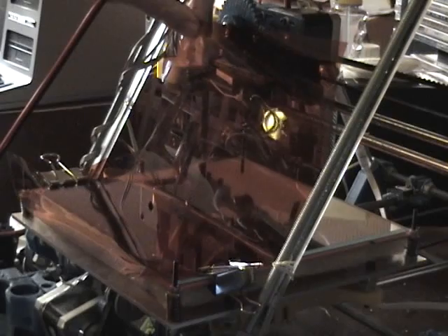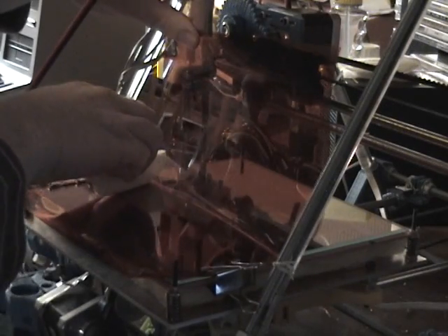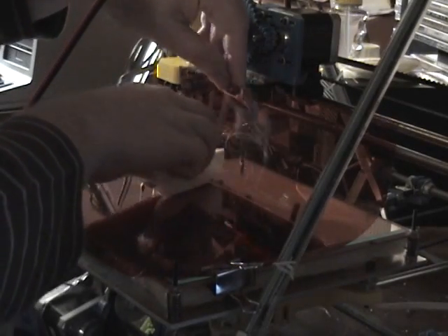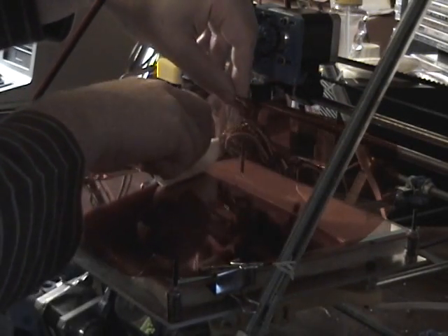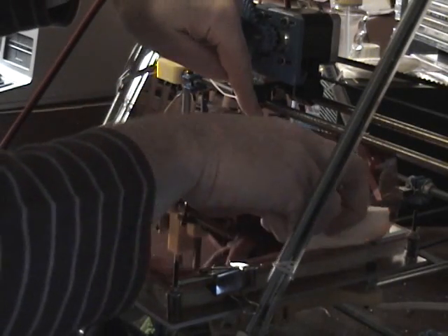They have to now go around the extra Kapton — that's okay. You continue working your way basically from the middle towards the edges, back and forth, to get a nice clean bubble-free placement of the Kapton sheet. The Kapton sheet is much thicker than your standard Kapton tape, as you can see if you've ever worked with Kapton tape, and that makes it a lot more durable.